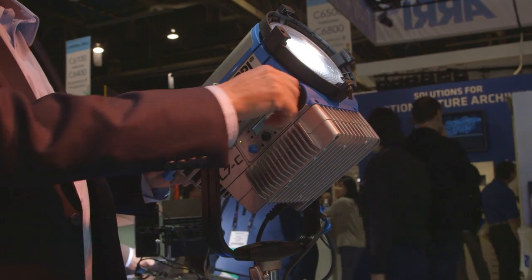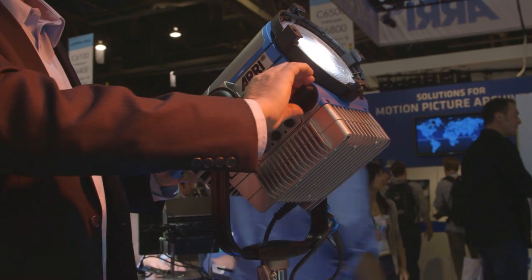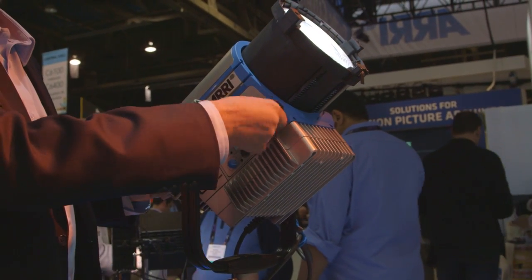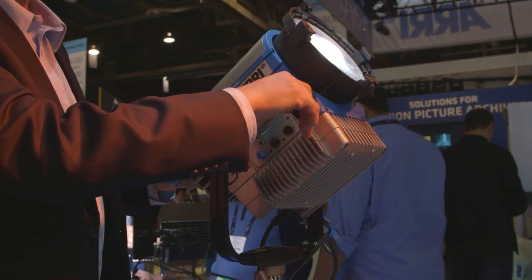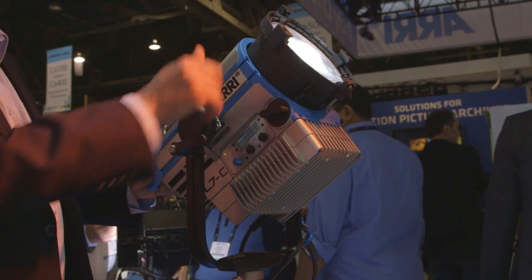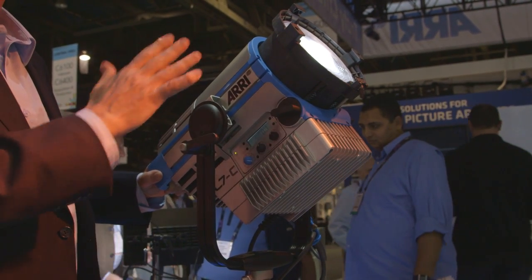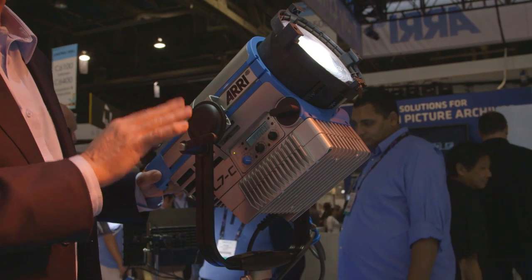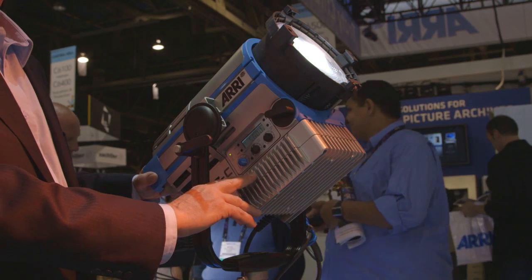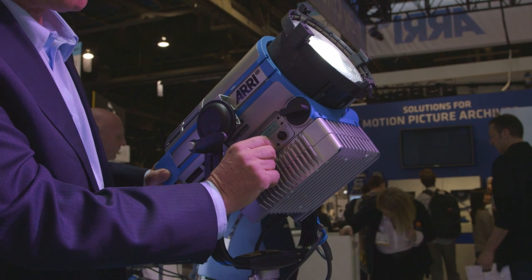This is the L7C, which behaves like a Fresnel — very good barn door cuts, very smooth feel. You can go from spot to flood by dialing in between 15 degrees and 55 degrees. There's a built-in brake so when you let go, the lens tube automatically locks in position, so as you push on the barn doors you're not going to change the actual beam spread. On board we have controls that let you change the correlated color temperature between 5600 and 3200, or anywhere in between, just by changing the knob.